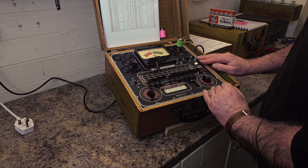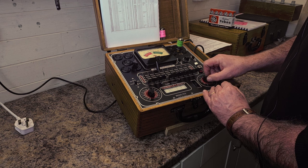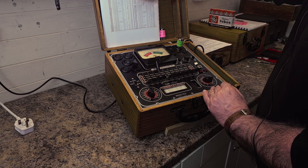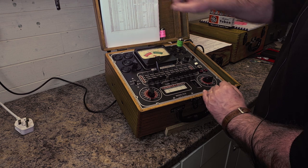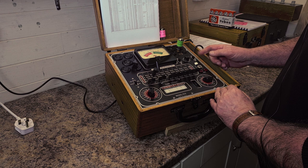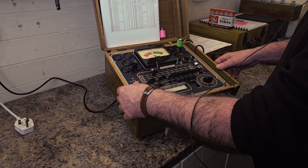Now for the quality test. From the chart, the load control goes down to three and the lever in the P position is lever two. This is a dual triode valve so we're going to test both triodes. We can now move the four-way switch on the left to the regular position.